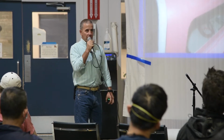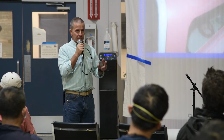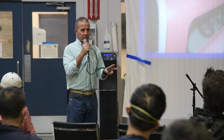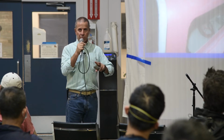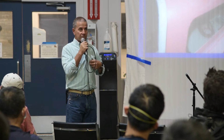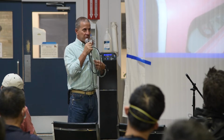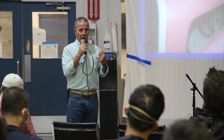So I haven't talked a lot about preparation, primarily because with the majority of failures of painted aluminum, the instinct of the people encountering the failures is, hey, the surface wasn't prepped properly, it wasn't primed properly, it's a coating issue. And interestingly, in my experience, that's the minority of cases. In most cases, it's because of assembly issues and not because of the coating.